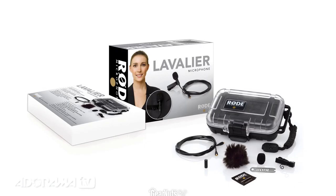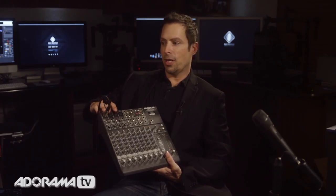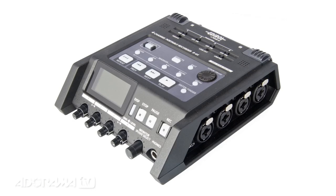I'm not going to get any of that signal noise that you generally get. Basically what I've done is I've intercepted the signal from the handheld microphone from the ceremony. If the sound technician has his own lav mics and you're comfortable using them, you can do the same thing. You can pick up a couple more splitters and basically intercept every signal that's coming into his board. You're just going to need additional splitters. So if there are four signals coming in that you want to intercept, you're going to need four splitters. If you have a four-channel field recorder, it works great.